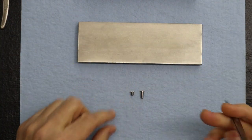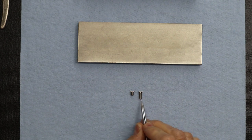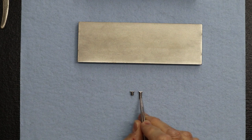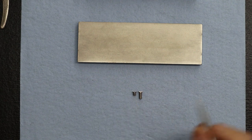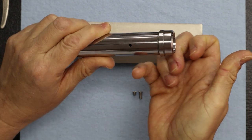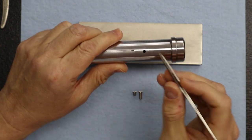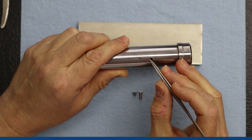See, as you can tell, when you order and receive the replacement key from Levin, you'll see it's really long. So what we have to do is cut it, grind it to the required length. See the difference? We're going to press the key in from the inside, and what we want is about a half a thousandth to one thousandth